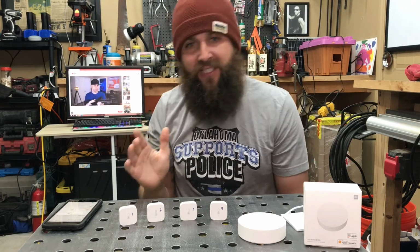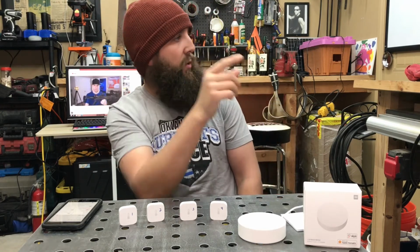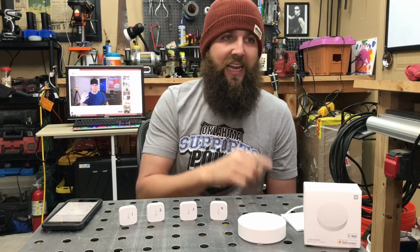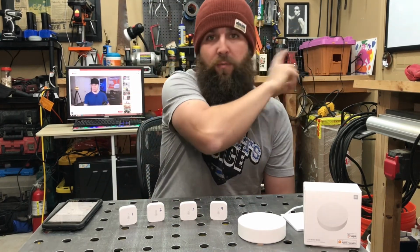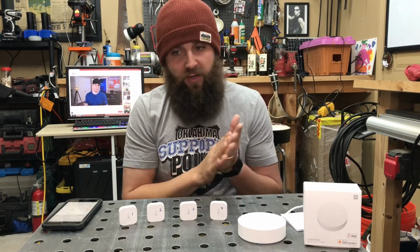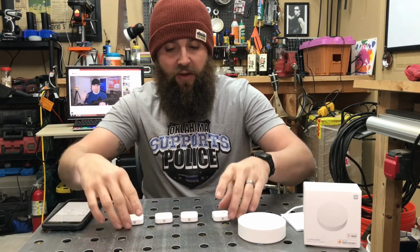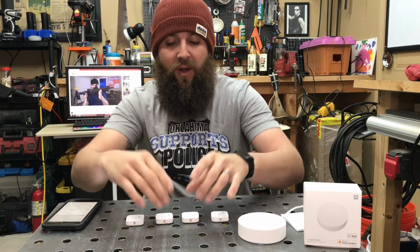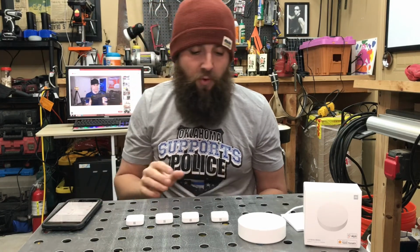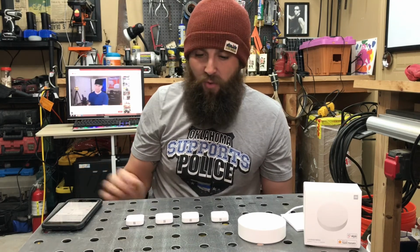And I was really happy to see that there is an expected and accurate change from the door to the wall, where we saw slightly colder, a little warmer, most warm near the insulated part of the house. So that gives me a good feeling that these work. When these sit still and idle for a couple days, their accuracy gets within 1/10 of each other. So this morning when I came out here, they were all reading like 14.8 or 14.9 degrees centigrade,